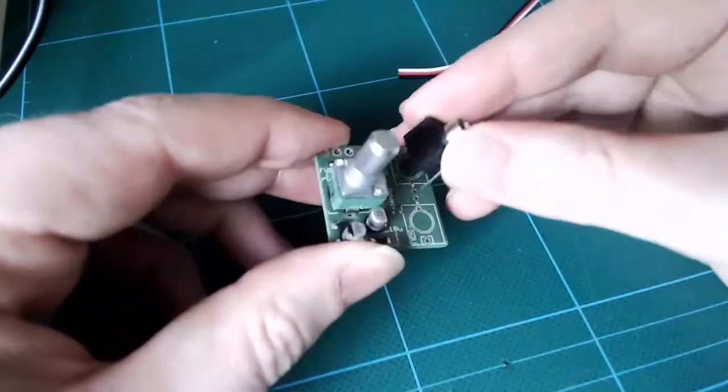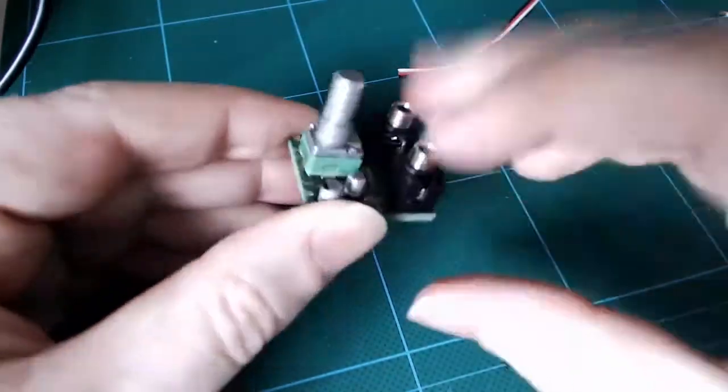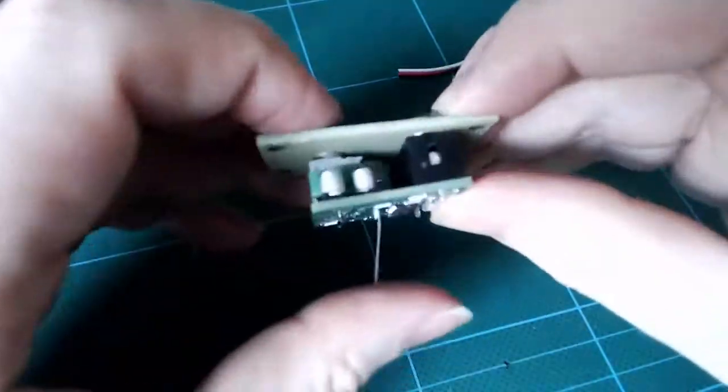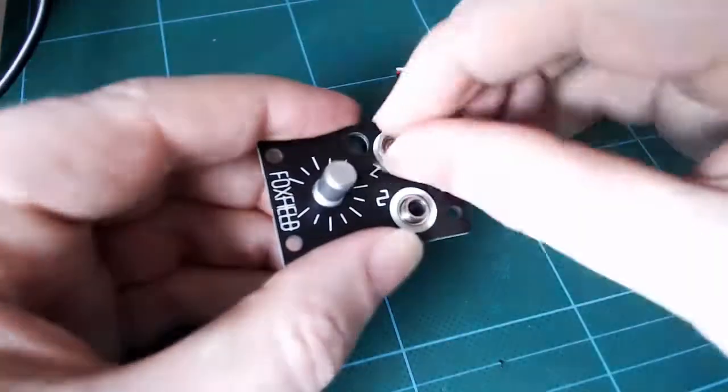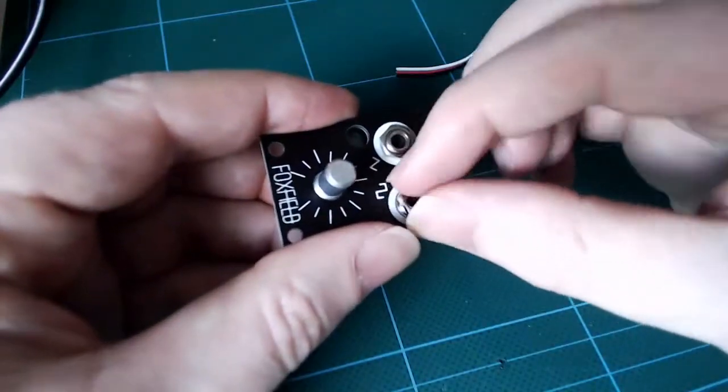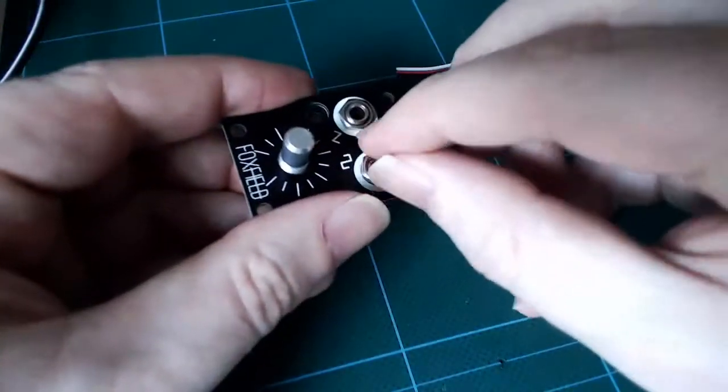And now we're onto the home straight. You might be a lot more comfortable with this part. We'll do the through-hole components from the mechanical bag. We put the jack socket, the pot and the LED in place. Remember, the flat edge of the LED lines up with the flat edge on the diagram, which is also where the short leg is. When they're all there, we don't solder them in place.